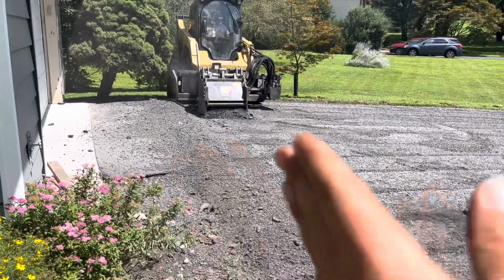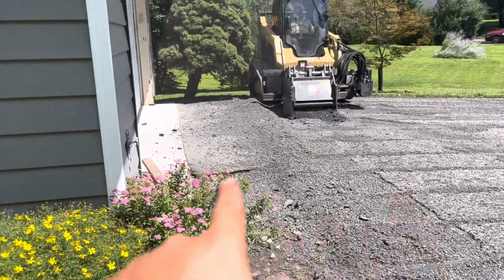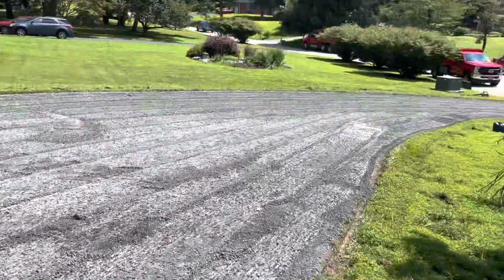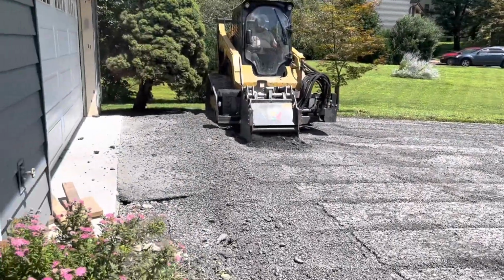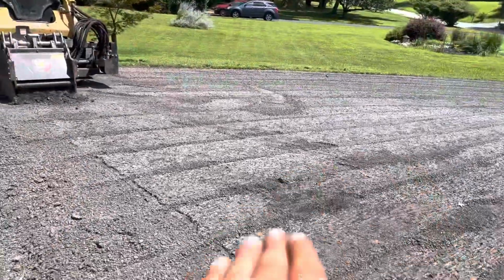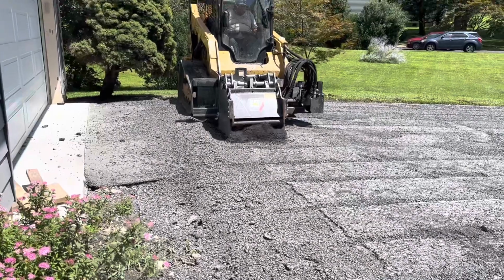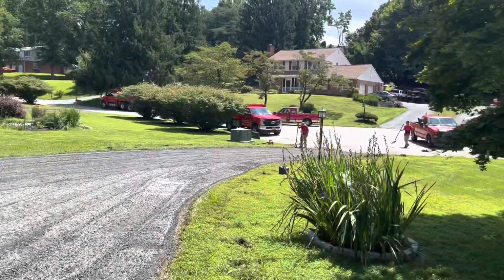We're gonna cut out a little deeper here and just pop this side up so we can have a nice flush blacktop to concrete meet. And other than that, we're really done milling. The next part is just popping it up and cleaning it down, and then roll it, compact the loose stuff, and that's it. And then we'll start paving here. We're looking good.